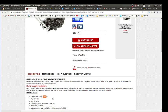You might have some, if you're moving a cylinder with something very, very heavy and you dead stop it, it will shake you around a bit too. So you might want pressure relief valves in that system. But for spinning things with a lot of inertia, you just can't use these. You could use this valve and just have a pressure relief valve that, when it spins, the pressure relieves and it slows it down.